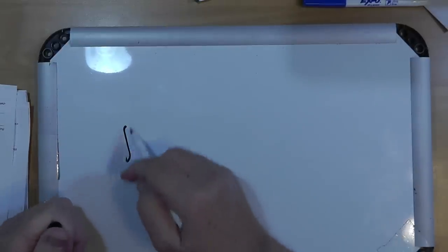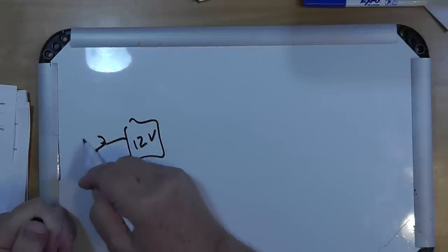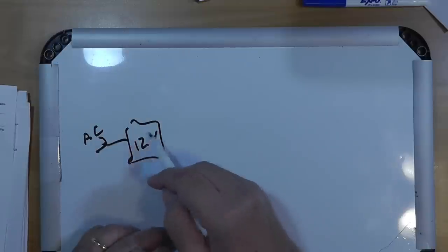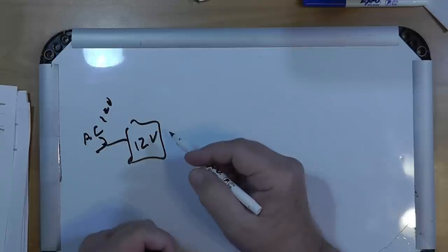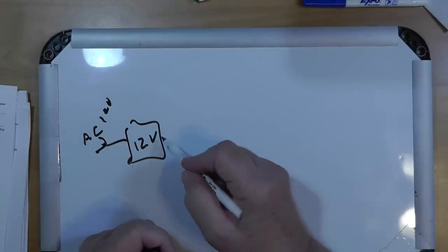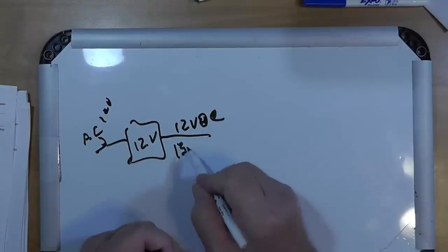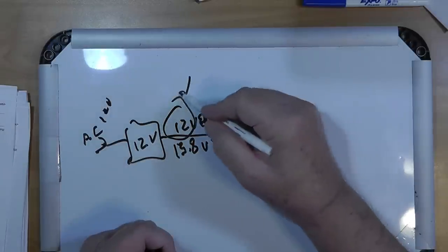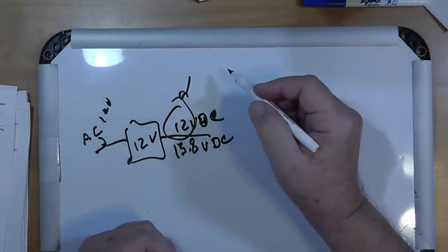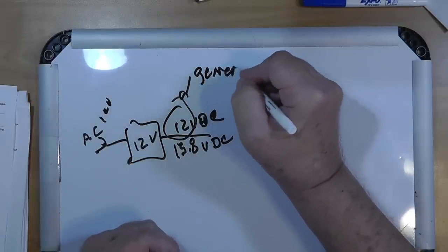Let's look at what's going on. He has a 12-volt — it's an AC input, 120-volt, 240 volts if you're abroad, or 220 depending on how your system is wired — and out comes 12-volt DC, which is actually 13.8 volts DC. The "12-volt" number here is a generic title for voltages in this range. They do not actually put out 12 volts.